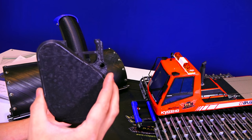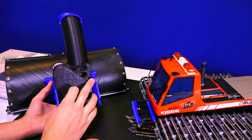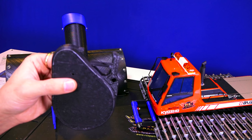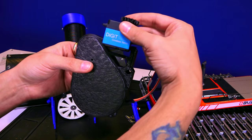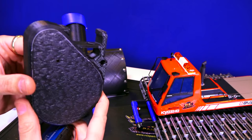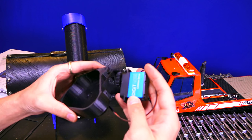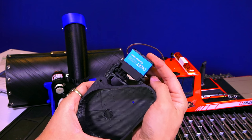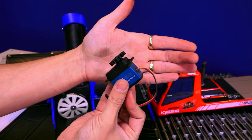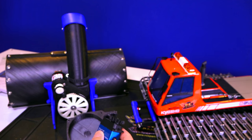With the back case fitting right on there, what I need to do is hook up that servo on top. My first instinct when I looked at it without reading the instruction book was, 'Oh, that's never going to fit — it's too big.' But if you look at it closely, it's actually printed to have a bit of a groove in there, so I would fit it in upside down like so. The problem is I do have these little gussets on the servo — little triangles — and I'm going to have to cut those out, so safety glasses on.